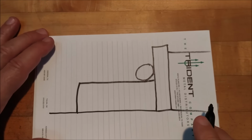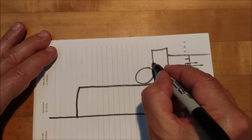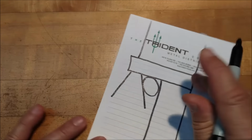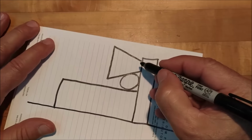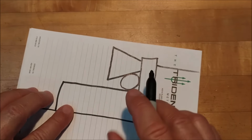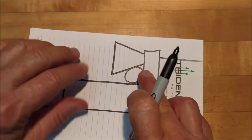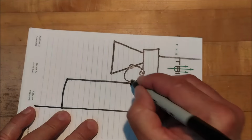I had a pin in here, and I'm going to draw this greatly exaggerated so I make my point. The draft on the part was this way. So if I said low side, in my mind, it is the low dimension, not the low side, not this side, okay? You want the wedge as such so that when you push down, as this comes closed, the pin wants to migrate back and stays right in that triangle. Tangent here, here, and here.